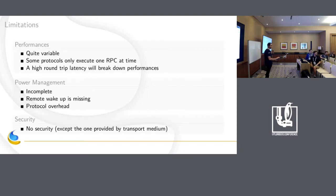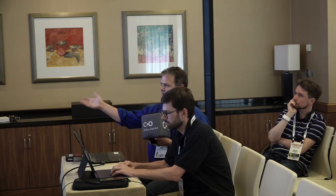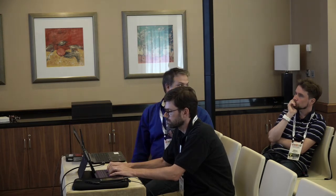Yeah, he's got some fun stuff he showed earlier today with the encryption working, so that was good. I'm going to do a little bit of an asynchronous question here, because I want to ask about one of the questions that's come up on the list, which is manifests and additional platform data, because a lot of these sensors that you want to connect up don't have the necessary platform data. So a manifest file on its own is not going to give you, say, an interrupt for an accelerometer. How do we get an accelerometer to just show up in this environment? How have you envisioned something like an accelerometer that has an interrupt dependency to show up automatically? And what do you think about the suggestion that we add additional platform data to manifests in some reasonable backwards compatible way?